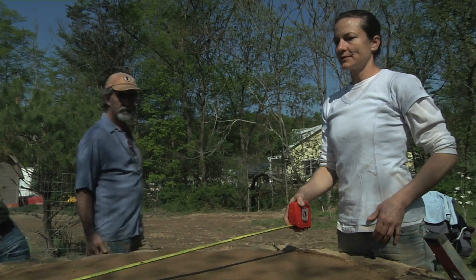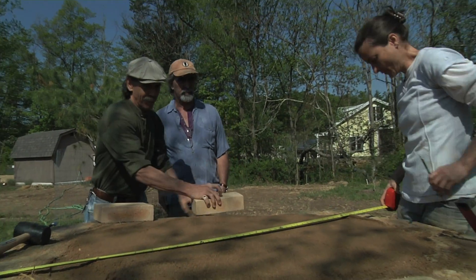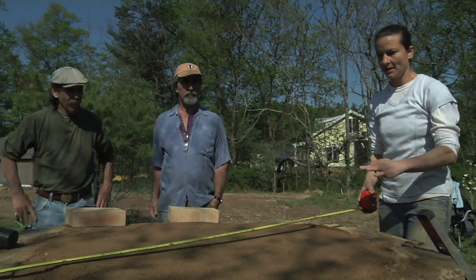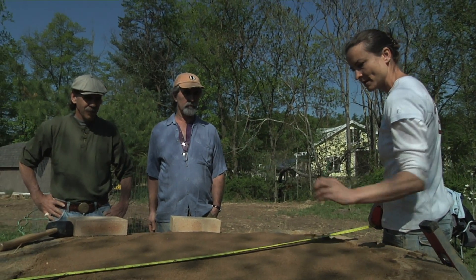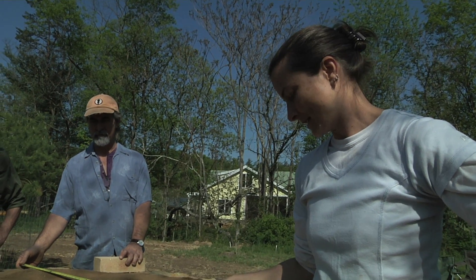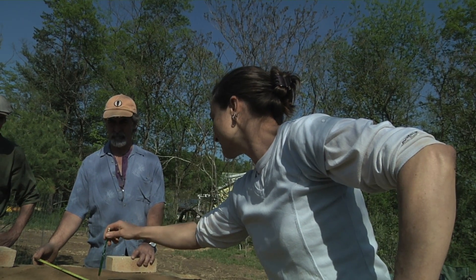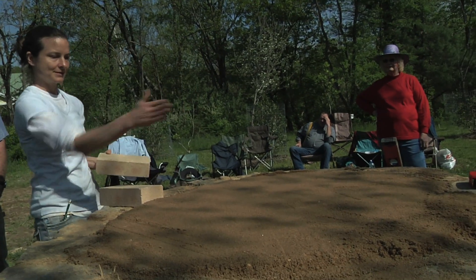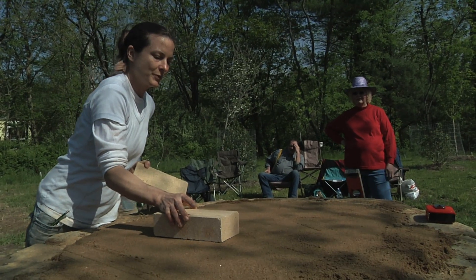What I want to do first is find the middle. In this case, the diameter of the stone base is 58 inches, so we're going to do half of that and check it 90 degrees from that — and now we're at 55. We're going to orient this way because that's where our door is going to be, and we're just going to start with four bricks.